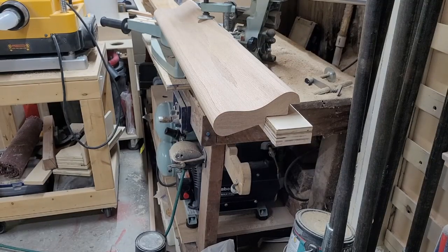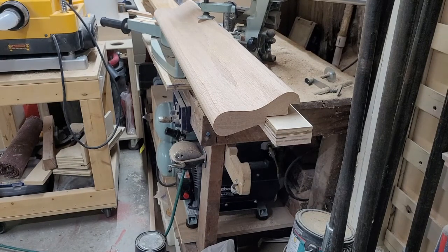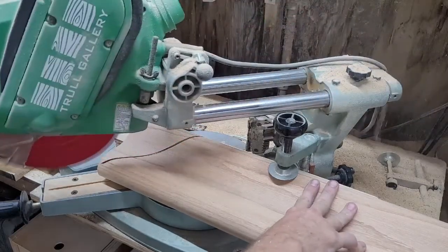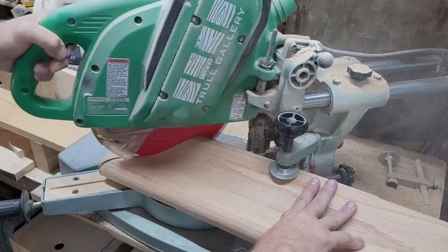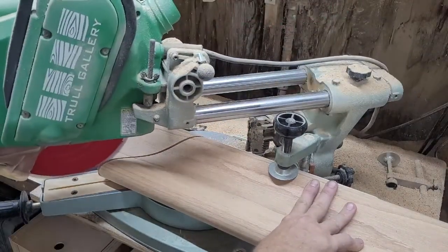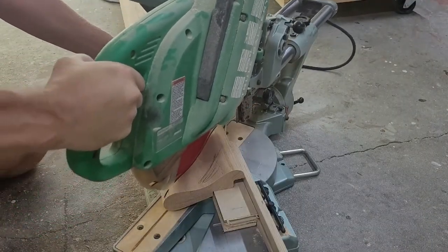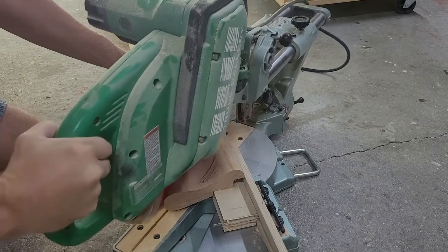I had cut off a section of bar rail more than long enough for the short side. Now that it's time to cut the miters on the end, I realized the bottom of the rail is angled, which would throw off my miters if I didn't make the cut square to the rabbets. I tacked a piece of half-inch and three-quarter-inch plywood together with a few pin nails to support the stock squarely on the miter saw, set the blade at 45 degrees, and clamped it in place. I took several passes to cut through the stock and — yes — found one of the 23-gauge pin nails mid-cut. Luckily these pins are really small and, despite the fireworks, did virtually no damage to the blade. The long section of rail was cut the same way but with the opposite miter. This molding is longer than my miter station, so I had to move my saw to the shop floor — and this time I knew where the pin nails were.